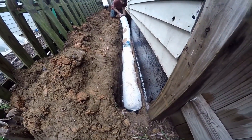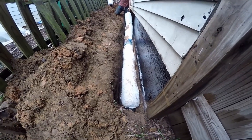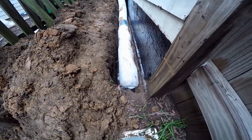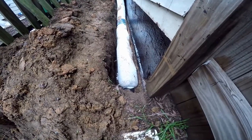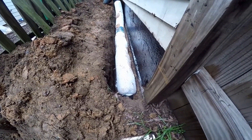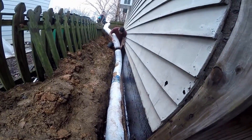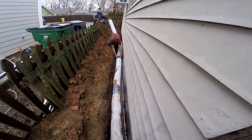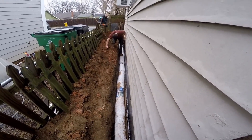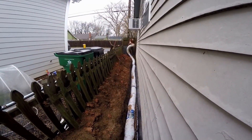What we're using here is called the EasyFlow system. It's perforated pipe surrounded by styrofoam peanuts, all encased in a fabric. According to the manufacturer, this has a 30% better flow rate than gravel — if that's the case, it'll work outstanding. We're going to give it a try on this job. The way it goes together, you just stick in an insert and push it together, then lay it down the trench. What we do is take a piece of pipe about six inches long, cut it in half, squeeze it, and slide it between the two pieces.